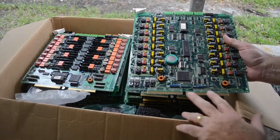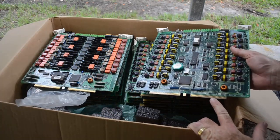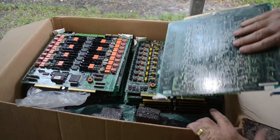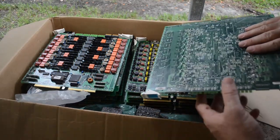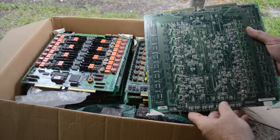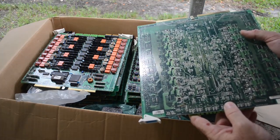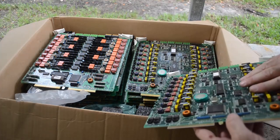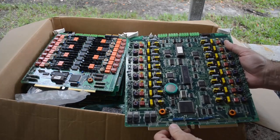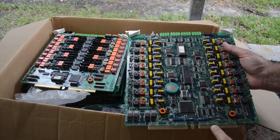The order I'll do it: first, I will get the gold fingers off before I do anything else. Because if I pop these in the kiln with the gold fingers on them, the solder back here could melt and run across them. Look at all the MLCCs on the back of that board — holy cow. They're pretty small, but there's a whole lot of them. So I'll get the fingers first — I'll just break those off so that solder doesn't run across them and entomb the gold inside.